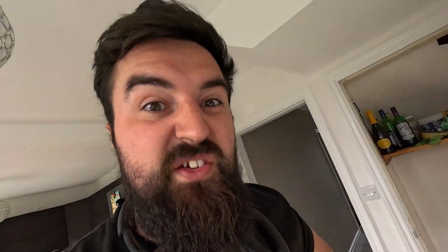They want an EV charger, so we've got capacity there - we can just bang in a double pole Type A, nice to be on that, and then just run a cable with a bit of EV ultra cable, like a Zappi or something like that. And obviously you've got your SPD protection already, so this is all set up just to add a circuit on in the future.